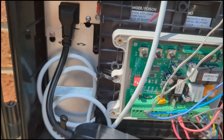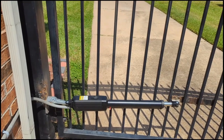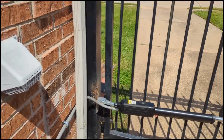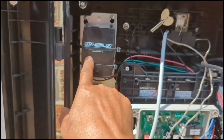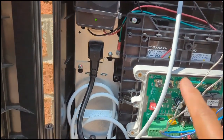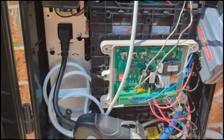So the bottom line on this video is: if you have an LA400 LiftMaster gate opener that gives up and you don't want to spend another $1,000 to have somebody come in and install a new LiftMaster LA400, the easier solution is to look for one of these Chinese-made actuator arms — you can retrofit it pretty easily. I used my existing box, my existing 24-volt adapter from LiftMaster, and the two batteries inside this box. I was able to salvage a lot of it. The controller that comes with it is much smaller, so if you remove the LiftMaster controller, you've got ample space to mount this. And as you can see, it's working.